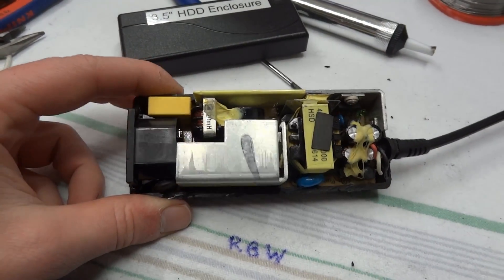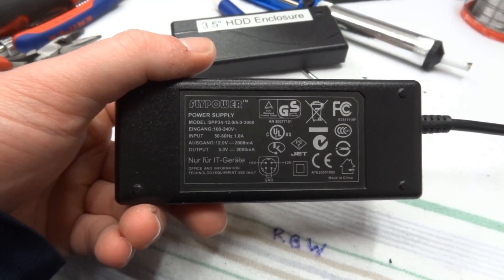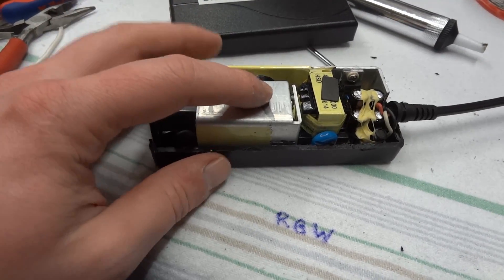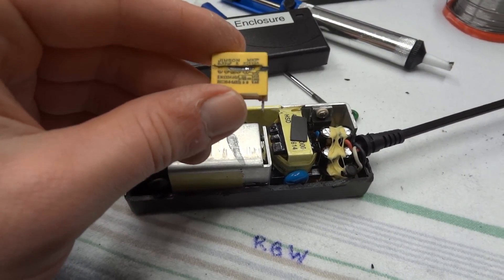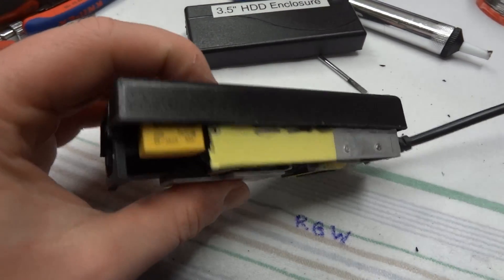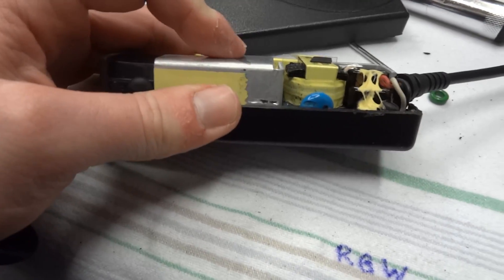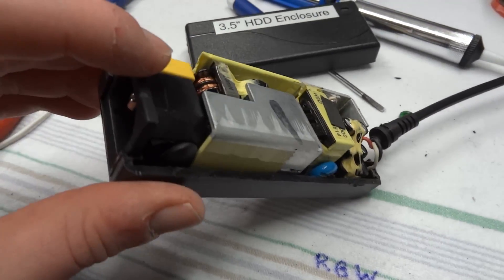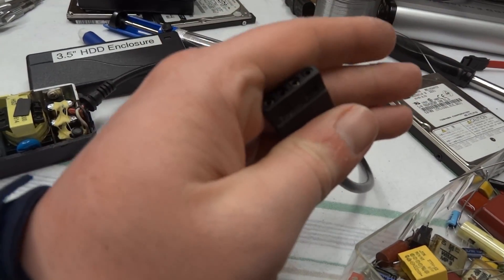So what I did was I found this — another 12-volt and 5-volt power supply that actually belongs to an external hard disk drive enclosure. I thought it looked to be just right, and it was. I did have a bit of an accident when I opened this up with a Dremel tool: I Dremeled into the capacitor, so that had to go as well. I did replace it — I had an almost identical device in my parts bin, so that wasn't a problem. I also Dremeled into another component but it doesn't seem to be damaged. I just soldered in the cable from the old broken power supply.